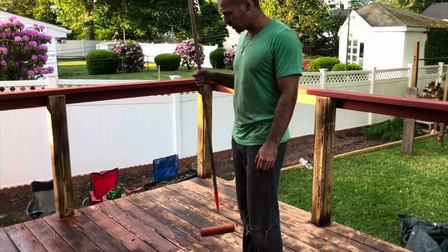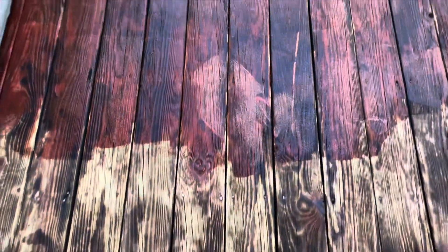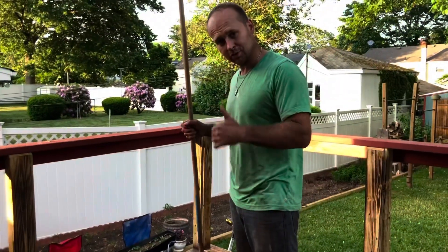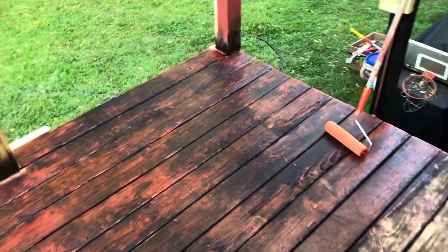As you guys can see it looks pretty cool with the red tint - the wood grain is still visible. I'm hoping these bubbles will go away with two coats, and that should do it. A can covers 300 square feet and this deck is 10 by 15. First coat actually looks really cool - transparent is definitely the way to go for the burnt wood finish I'm doing. Also forgot to mention - don't do a little section going sideways; do each board lengthwise all the way so you don't have any overlapping of the stain.